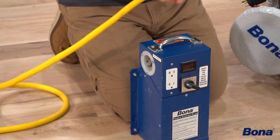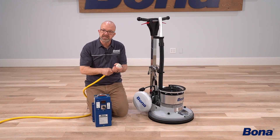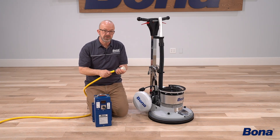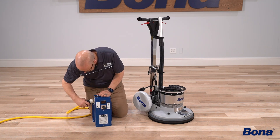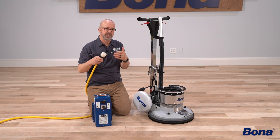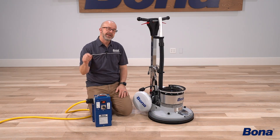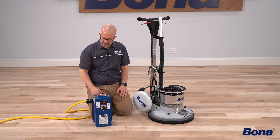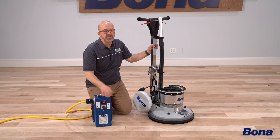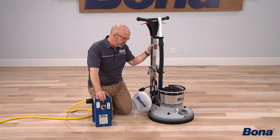You also always want to check your plug. Any of your plugs, whether it's the one on the wall or anything connected to your cable - are they secure? Are they tight? Probably a good option, maybe every six months, take them apart, loosen them up, put them all back together just to tighten them up, make sure everything is nice and tight, and are they in good condition? You don't want a situation where maybe you had a problem at the wall plug and it sparked and burned your plug - that may have done some bad things to the inside of your plug as well. Check your cables, check your plugs all the way along your route, and make sure that what you've got going into your machine is the same as or greater than what you've got coming into the booster.